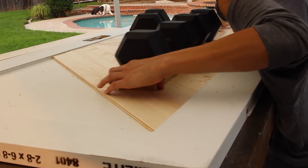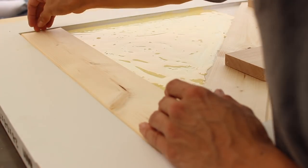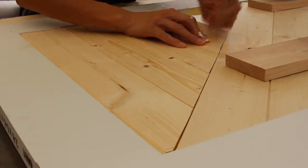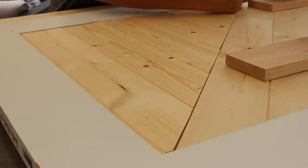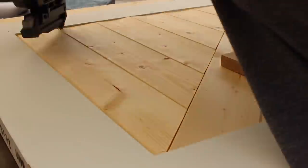A fun fact - not so fun, actually. You can see how the wood is curling. I originally set up shop in the garage where the laundry room is, and I didn't take into account that when you're washing and drying, it instantly becomes humid and warps whatever wood is sitting in there. It was a fully flat door, and then I woke up the next day and it was a little bit bent - some texture starting to show. That is why I moved outside.